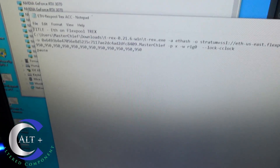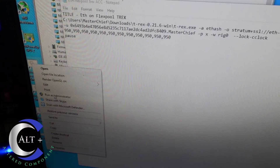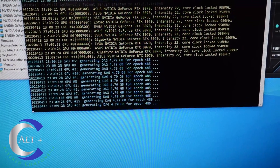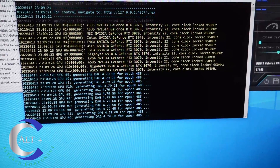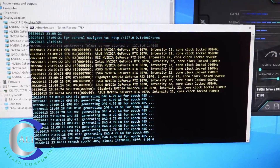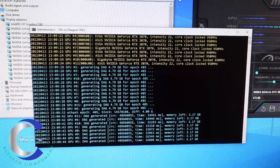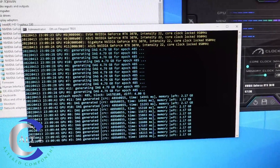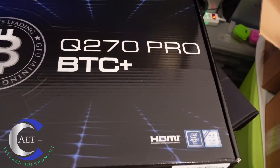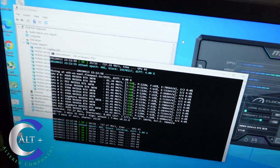Let's fire this thing up and see how she does. We're running as admin because I'm using the absolute core clock. I have a feeling these server power supplies are going to spool up a bit — I'm running on 120 volt with a 1200W HP running at 900W, a 750W HP running at 750W, and an 850W EVGA. There you have it — the ASRock Q270 Pro BTC Plus hashing away, all 12 GPUs running strong and running proud.